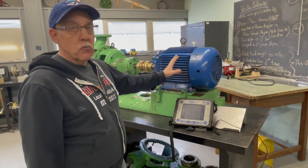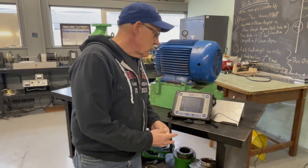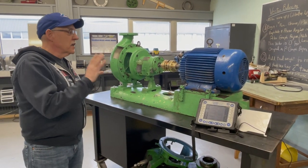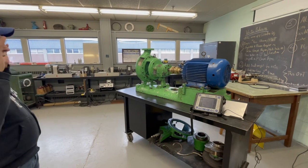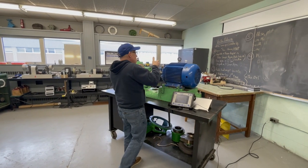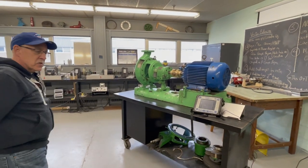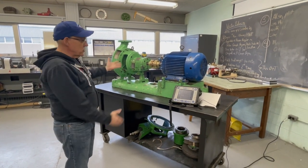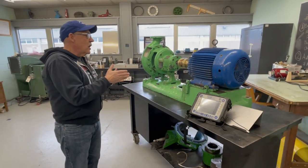This is how I would actually take a reading on this piece of equipment. When we go out doing our vibration readings, we're focusing on the piece of equipment. As I'm walking up, I know there may be a fault, and we zero in on the equipment — not looking around for piping or sharp edges. A lot of times this pump is down in a hole or up in a really high location, so they're not always easy to access.